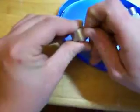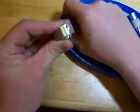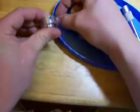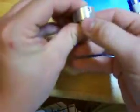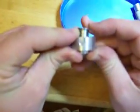I'm sorry I'm rushing through this at the moment, but I found that the first time I did this it was over YouTube's limit. What you do, you load each two into each one and rotate the tool round until you're at the final hole. The next part, if I can get hold of the last two, is to rotate the ring to a position where no ball bearing can escape, and gently ease the center plunger.